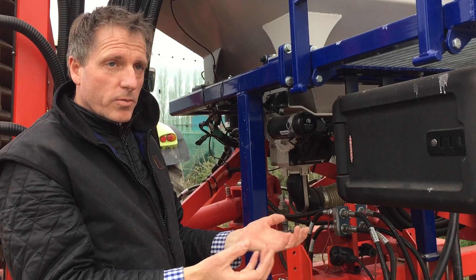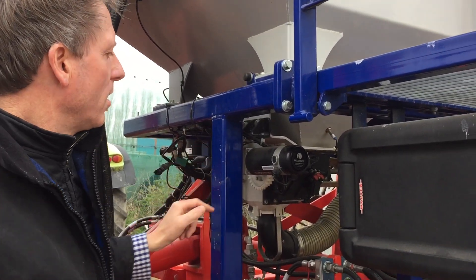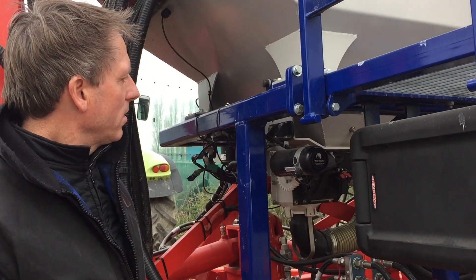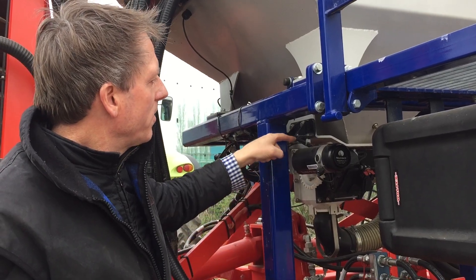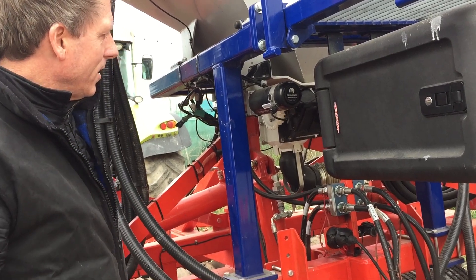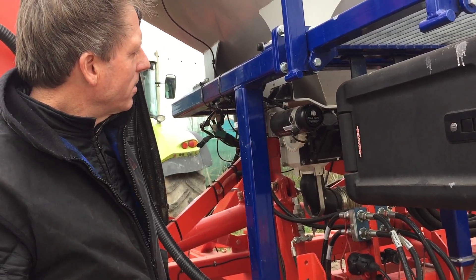That magic weight from the calibration cycle is entered into the monitor. You can see the motor slowing down now — that's done a perfect ten turns. If for whatever reason you want to run the calibration again, put your empty seed bucket under here to catch the material and just hit the go button. Once the monitor detects the motor's started, it takes over and spins the metering shaft a perfect ten times. You hear the motor rev down towards its last turn — there she goes, it stops.